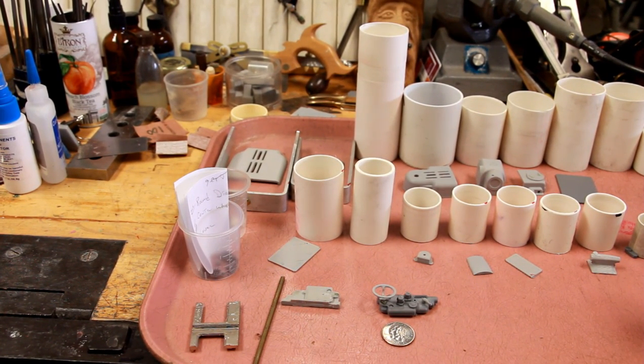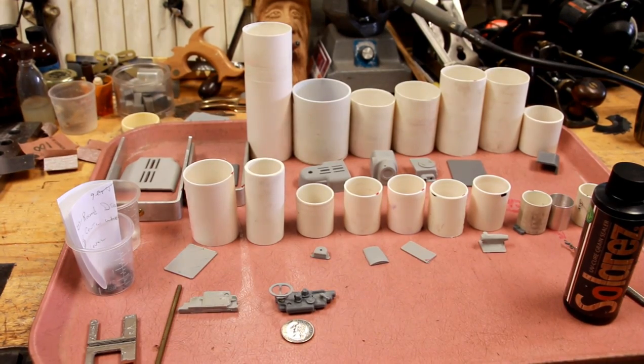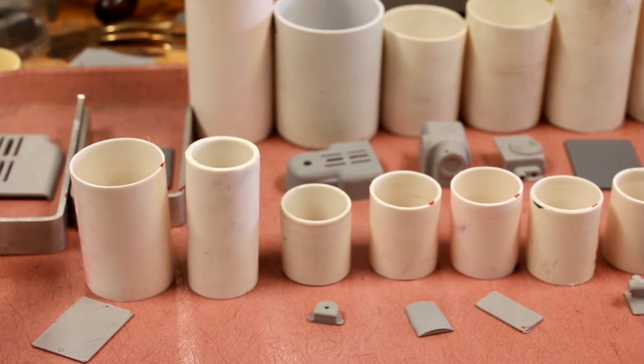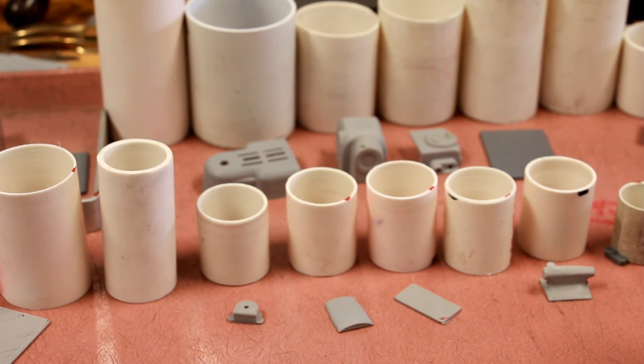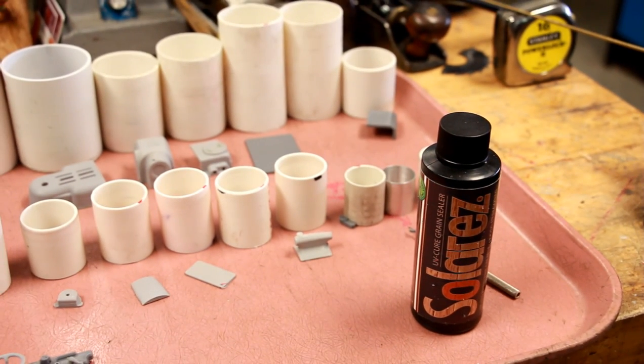Some of the parts that will be machined will probably bring the count up to around 70-75 parts for this finished product. What you see here are individual sized PVC pipes with a one-and-a-half degree taper inside, and in front of each mold frame are the parts that will go into that corresponding mold frame behind it. The quality of the 3D printed parts I'm achieving off my CR-10, which is an FDM type printer - some are crisper than others depending on geometry. When you get down into tiny tiny parts, they lose a lot of crispness.